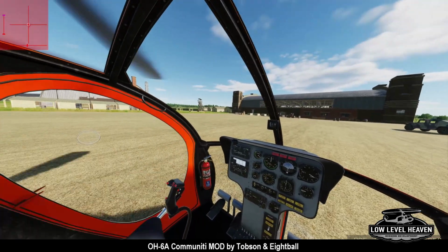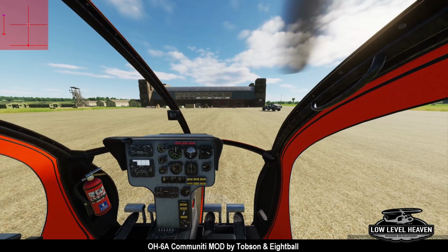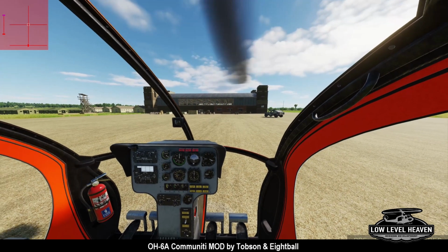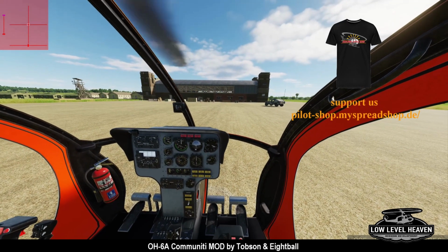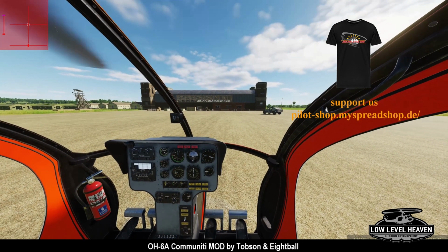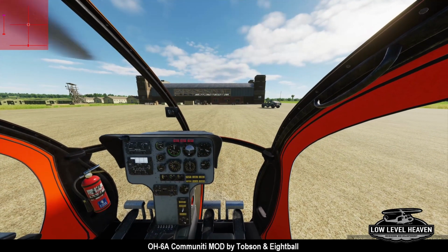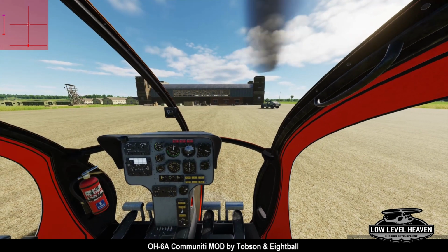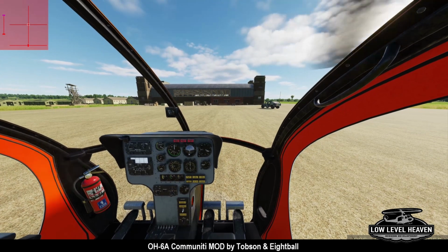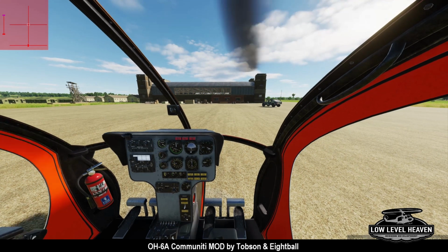At the moment we have pretty much the controls centered, the pedals pretty much centered, the aircraft is on the ground, but the aircraft is already running in flight idle, so there is already a lot of torque on the system, and there should be a tendency to turn the nose clockwise because of the torque already existing, but the friction on the ground keeps the aircraft stable, because the weight of the aircraft and the friction to the ground resist the torque pushing the aircraft clockwise.